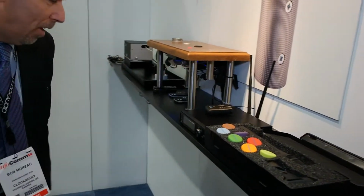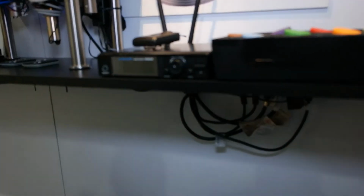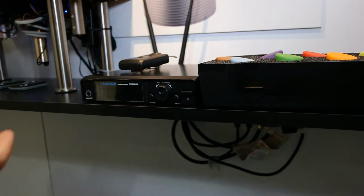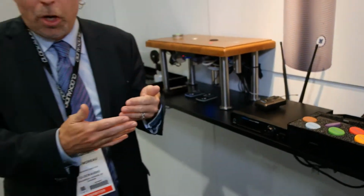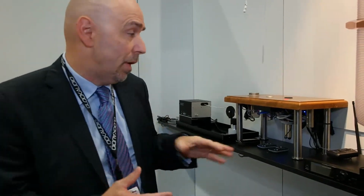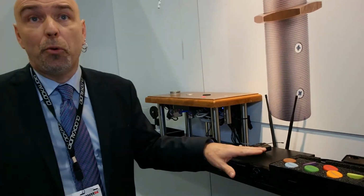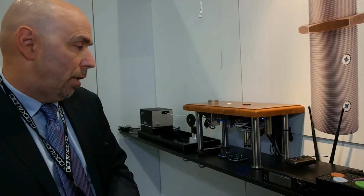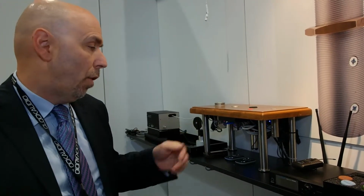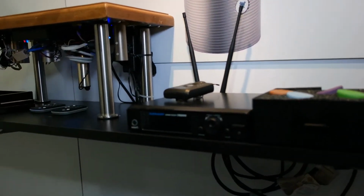Here we have our CW8000 system. That's a new wireless UHF system. The reason why we came out with this, because right now there's still some more frequencies that we're going to lose that are being auctioned. We wanted to give more flexibility to the end users and the integrators. So this one, as opposed to having 192 frequency selections, it's got 3,000. It also has auto scan, and you have two levels of power for transmission. So you have 10 milliwatts or 50 milliwatts to give you more of a range.